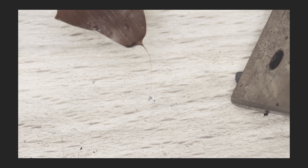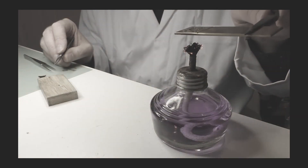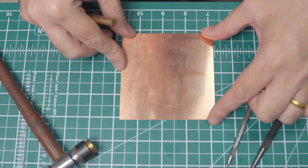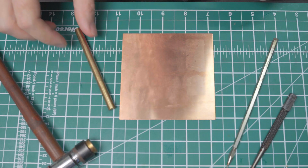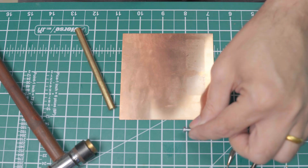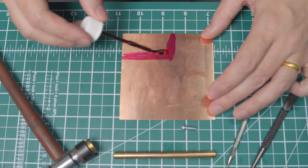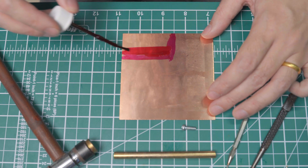As you can see, a pallet warmer is a very simple tool. My old version here is a piece of brass and I was using some tweezers to hold it and a small block of wood to protect my work surface. So I made a simple design using a piece of 1mm copper sheet, an 8mm diameter piece of brass rod, and an M4 screw to hold the pieces together, and I started by cutting a piece of copper sheet to size.